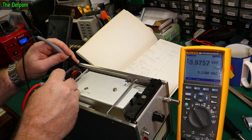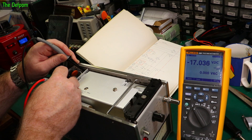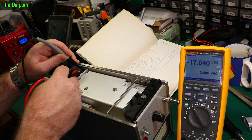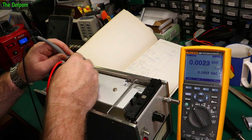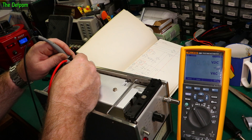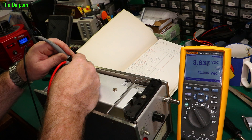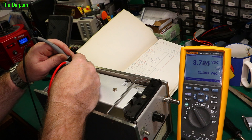This bundle of wires here is minus 17 - that's the ground reference, so that should be minus 17.5 volts. It was slightly off there. AC ripple - nothing showing up. Pin 20 is here, measuring 77 volts, no ripple showing up. Pin 19 has a low dribble on there: 3.6 volts DC and 21 volts AC. So pins 19 and 17 are a bit of a strange setup - I don't think there's much smoothing on those particular pairs.